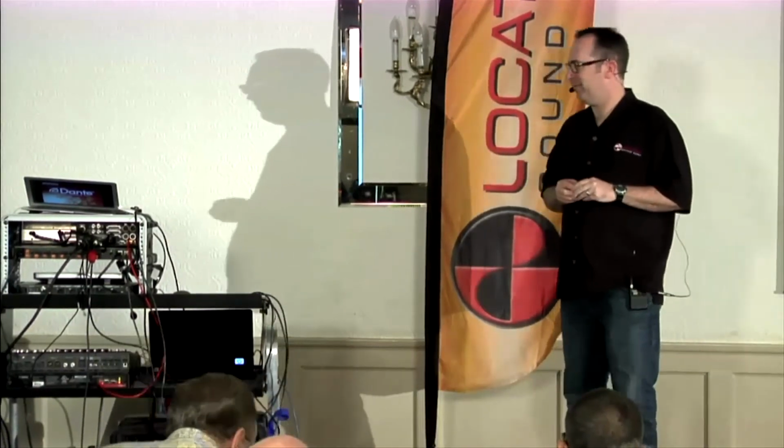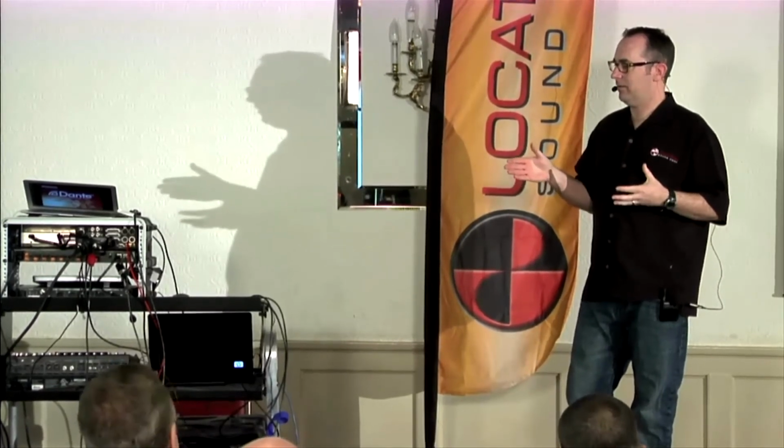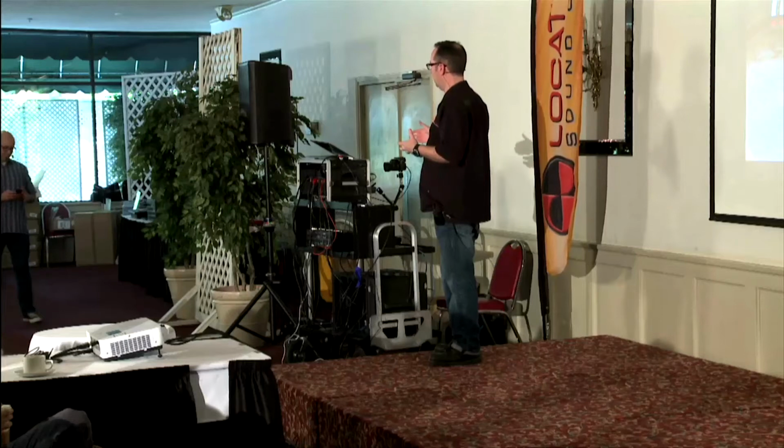If we used analog cabling or digital or AES, I probably would have charged you $100 to make that cable, just because it's a pain to solder those DB25s, and I hate DB25. But with a Cat5 crimper and some cheap Cat5 cable, I can make a cable in about 10 minutes. I'm getting better at it, but I bought a better crimper, so now I crimp with impunity. So just in that, it's a good cost saving in just materials.